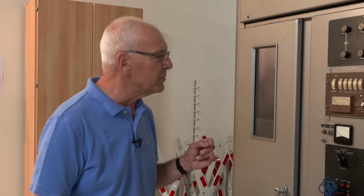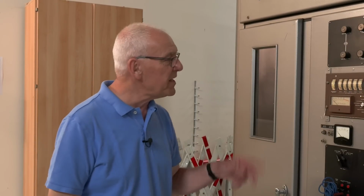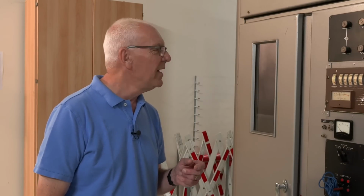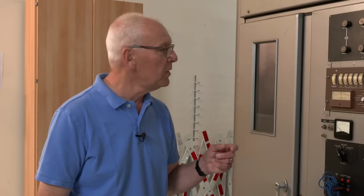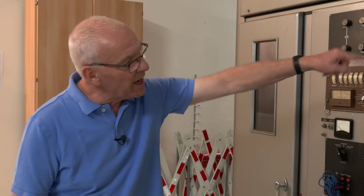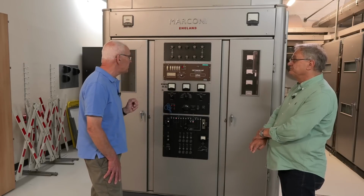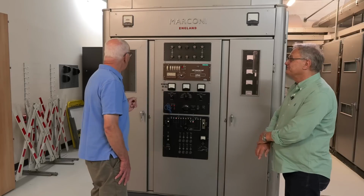But the actual audio comes in via a 600 ohm transformer to keep the nasty RF out. And the first thing it finds in there was a Leak mono valve amplifier. They called it the preamp, EF86, ECC81, EL84s, push-pull. And it had two outputs at 100 ohms and fed one side of the audio amplifier and the other side in push-pull. So two identical sides. The first thing it hits is a TT21, which is a KT88 that you mentioned with the top cap. Yeah.